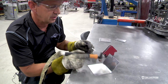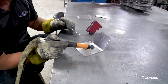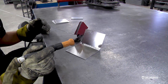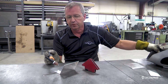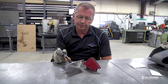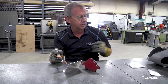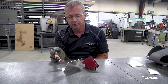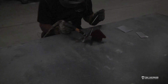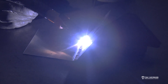This is 060 material, so that's about the size weld you want to put in there - about the right width and right temperature. You want plenty of penetration but not a bunch of burn through on the backside. Out of all the welding we do, if you're gonna weld aluminum you really want to spend time practicing because it doesn't take much heat to get it to burn away. I'll finish welding this and I'll turn up the heat to show you what it looks like when the heat is too intense - we did that on some of the other welds for comparison.